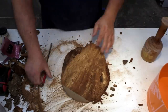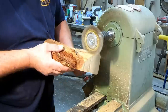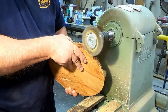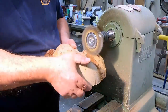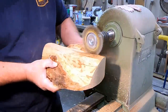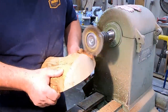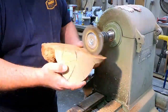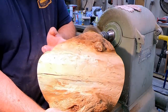And for those who are not aware of it, it's not a good practice to use epoxy or resin to bond the bark, because over time the bark can delaminate from the wood and then your project's going to fail. Along with that, when you strip the bark off a lot of species, the underlying wood can be very, very slick. So it's best to give that a tooth, and that's what I'm doing here with the brass brush, just giving a bonding surface for the epoxy to stick to, and of course to clean up those burl areas. And there you go, ready for casting.